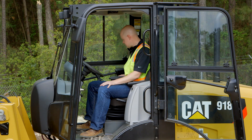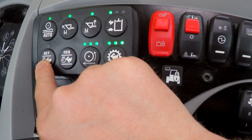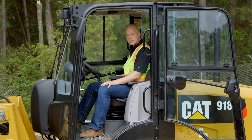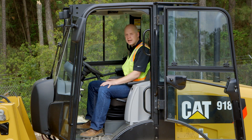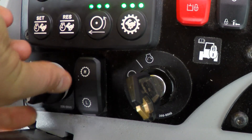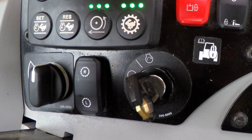This is a great feature of the M-Series Compact Wheel Loader. And last on the keypad is your throttle lock. This works just like cruise control in a car — you push your right pedal down, set your engine speed where you want it, hit the set button, and you're good to go. There's also a dial just below that soft touch keypad, which is your ground speed adjustment, also known as creep control.